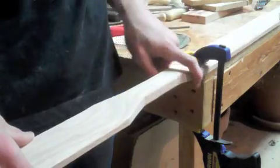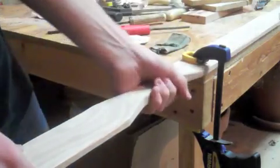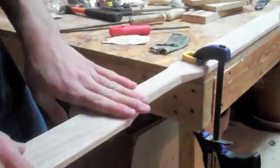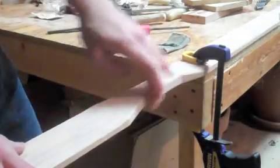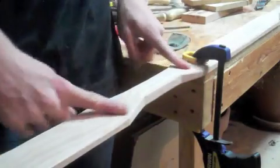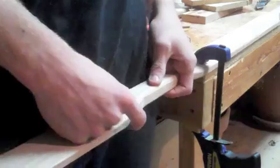When you're sanding, you need to pay attention to around the handle, especially on the edges, the fades right here, and any place where it cuts across the grain on the side. So the fades are a big part because the stain will soak in there and make it a lot darker than the other parts will.